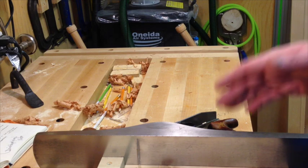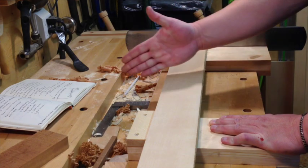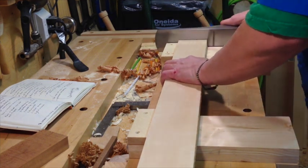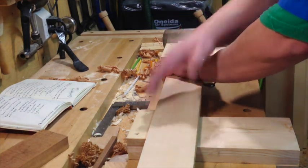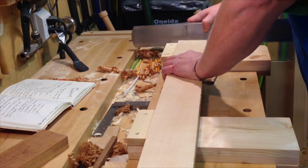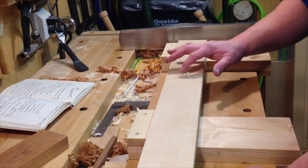What if the board is too big to fit on this shooting board? I have a solution: another one made from the same material at the same time — I made it extra wide and cut it in half. I can bridge a long board with that and still shoot the end, without worrying about it pivoting. I've made sure the two fences are compatible so I can square off the end of a rough board. You end up with these lovely feathery shavings of end grain — there's nothing nicer, and they're really good for starting a fire too.